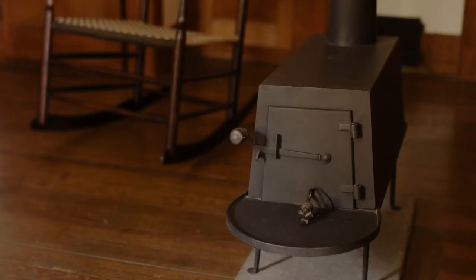The efficiency of the stove, from my experience — and I've used the Shaker stove for a number of years — is sometimes understated because of the small and compact nature of the stove. The Shaker wood-burning stove was designed to work at a very, very low air inlet setting, so that the small wood capacity of the stove did not burn through quickly, and they did not have to keep feeding logs into the fire. The ability of the stove to generate heat when worked to full capacity would not allow a person really to be in the same room with the stove.